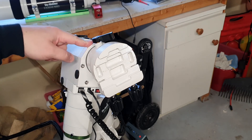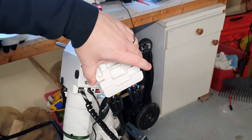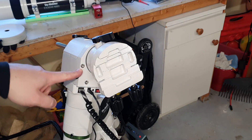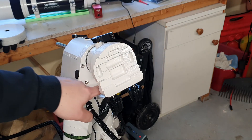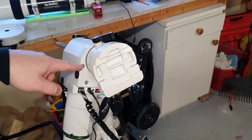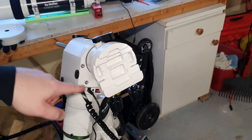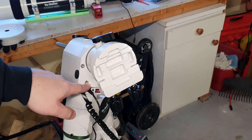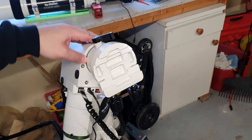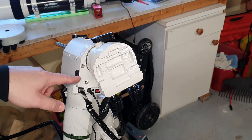When the adjustment has been done and you don't feel any backlash or movement whatsoever, you can tighten the three grub screws. Be very careful that you tighten each screw just a little bit and go clockwise. Don't tighten one all the way and then another, because that might cause the worm drive carrier to go out of alignment inside.